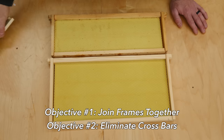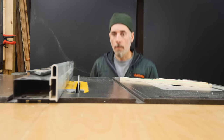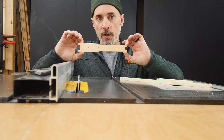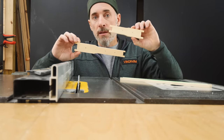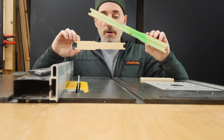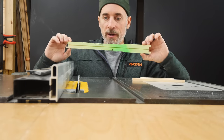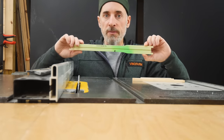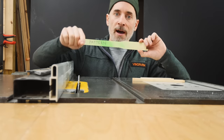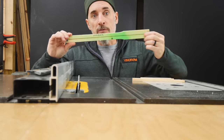That's when I had to develop sidebars to make big one-piece frames. This is your standard Langstroth deep sidebar — you can buy these at any beekeeping supply place. This is a medium sidebar, and this is the bee barn sidebar. I had to go on YouTube and do a whole bunch of searching to find out how to make these things, but I did figure it out and learned how to do it with the table saw. This shape requires eight passes through the saw, plus one more pass for the groove going down the middle.